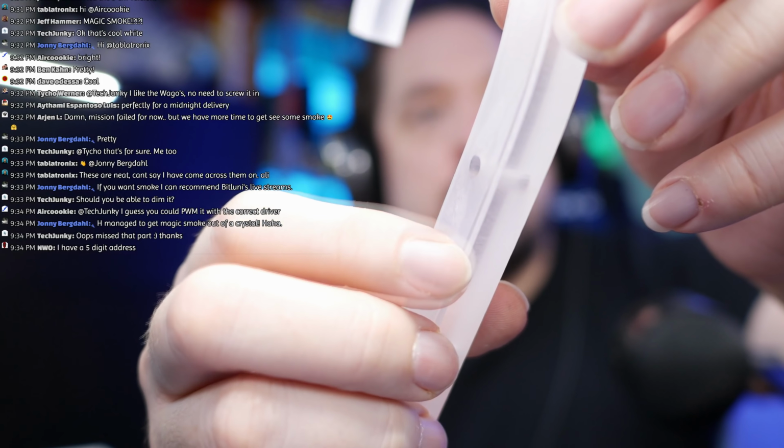Let's add this to the strip. There we go. Of course, now I can't put it down anymore. It'll work out. And then we just melt the pad on the strip, like that, and we push it in there. There we go. See, soldering is all about tricks. If you make sure to solder on both sides, it becomes very easy because the tin likes to go together.